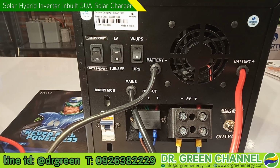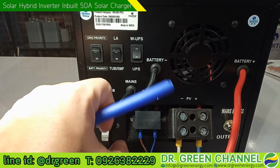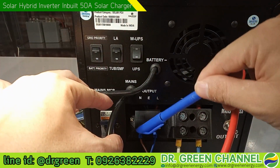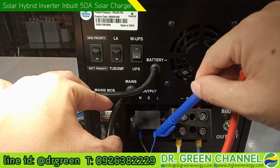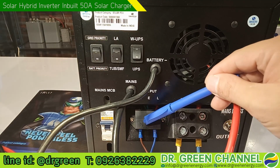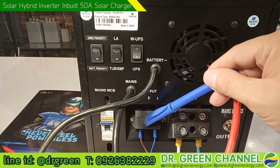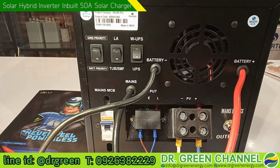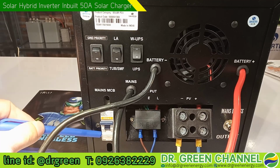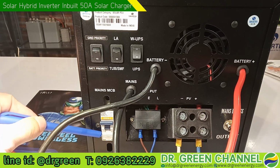And the next one is the AC output, which has the neutral, earth, and line. You have to connect it correctly. In the middle here is the earth. For safety, every time you use the inverter or electricity at home, you also have to connect to the ground or the earth. And this one is the MCB breaker for safety.